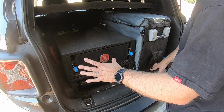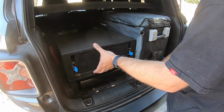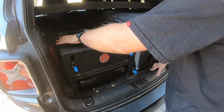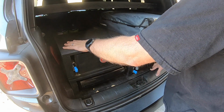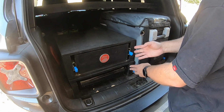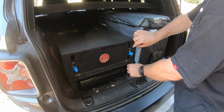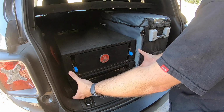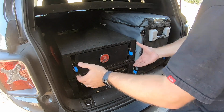It was all done in 1/4 inch MDF. I wish now that I had done it in 1/2 inch. It would just make it easier. Sometimes the wood ends up splitting a little bit when you start screwing it together. These uprights are 2x6s, so that gives it some nice stability here that I can mount my side rails to, and it gives it some height and some bulk.